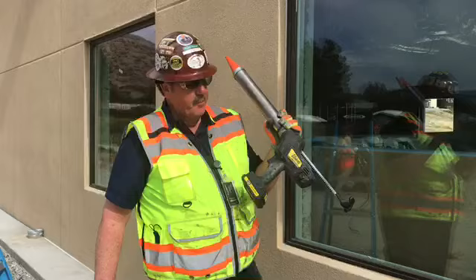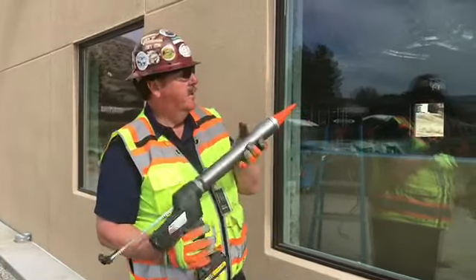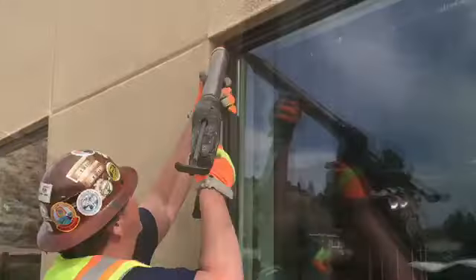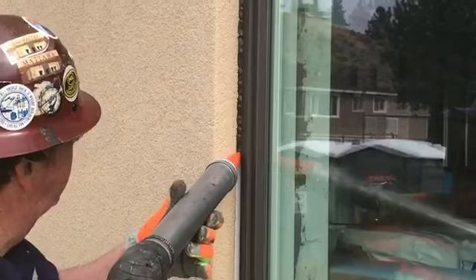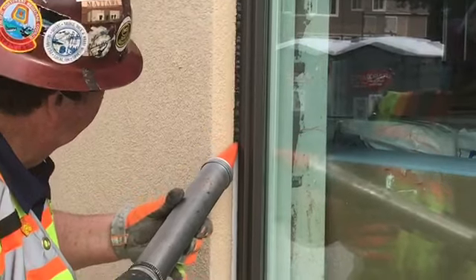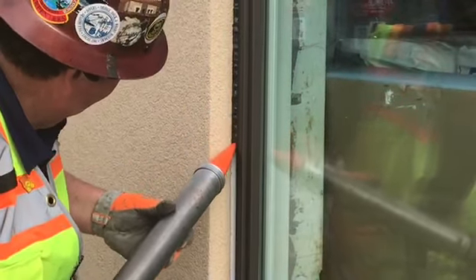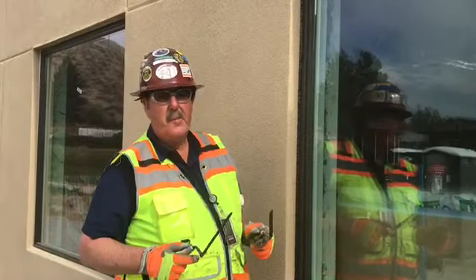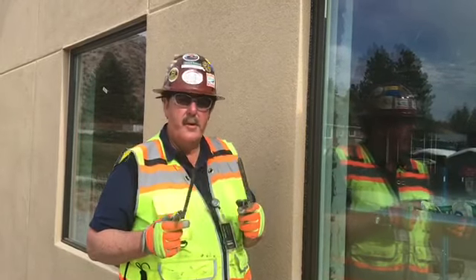What I'm using today is an Albion electric 18-volt. Watch how I slowly put that in the proper place. In order to seal this properly to the EIFS, I can't use a spatula — I have to use a tapered tuck pointer. The first pass is just to find out where it's going to go and how much I have there.